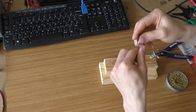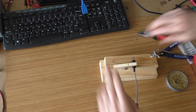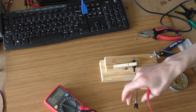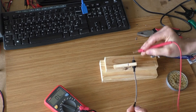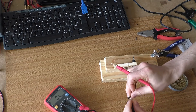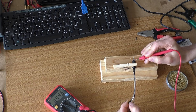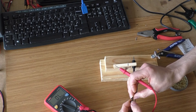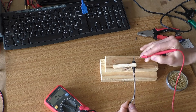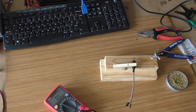It looks like we have our cable ready — let's double-check all the connections using the multimeter. The ground should read continuity — yes, that's fine, it's the ground. This one is our RX — confirmed. The white cable is TX — that's also working. And this one shouldn't give us any reading on the others — just making sure — yes, that's fine. So the hard part is finished.